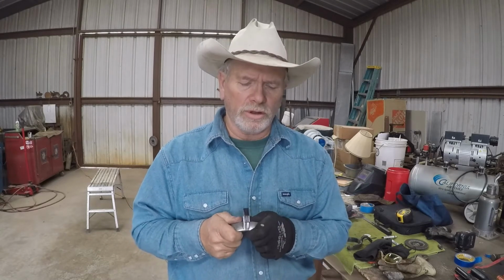But anyway, I used to split all my shanks with a chop saw, and it's pretty dangerous. The chop saws have a lot of horsepower, and if you're standing there holding the spurs and you don't keep the angle just right, the chop saw can yank the spur out of your hands and toss it back at you, or across the room. And the blades can come apart. Even with protective gear, it can get dangerous.